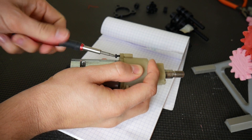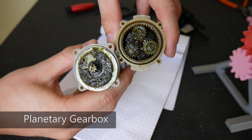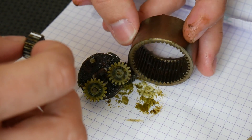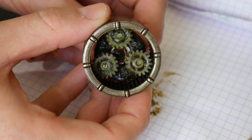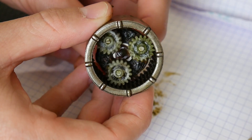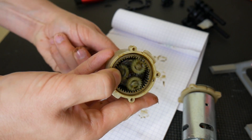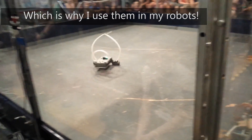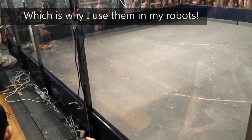This is my run-of-the-mill cordless drill. It actually contains what's known as a planetary reduction gearbox. Instead of having one planet gear, it has several — three or more per reduction stage — rotating around a Sun gear. Instead of a linkage to create reciprocating motion, there's what's known as a carrier plate which holds those planet gears in place, and a stationary ring gear to mesh with those planet gears, which are now free to rotate and pass the reduction forwards to the next stage through the carrier. Planetary gear trains are durable, as many teeth are in contact at any one time, making it unlikely to shear them under heavy load, and they're capable of very high reductions in a compact form factor.